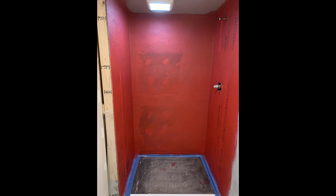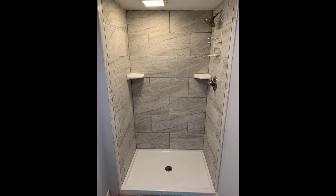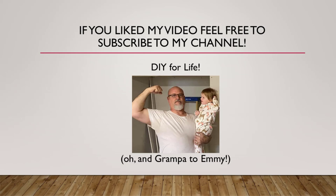I'll show you a few pictures of the rest of the project. You can see the waterproofing I did - I used mesh tape on all of the seams and put a special waterproof caulking on all the screw holes. I did at least two coats, and in the bottom part at least three. You can see where I was putting the tile in - two-foot by one-foot tile. The final picture shows the tile work completed, just needing to finish the grout. It's been working out great with no problems. Thanks for watching, and I'd appreciate you subscribing to my channel. Good luck with your DIY.